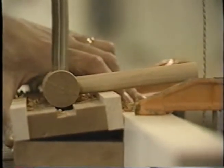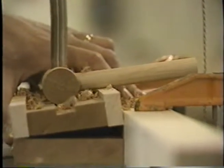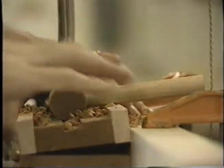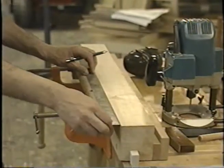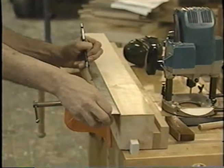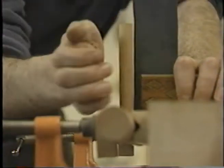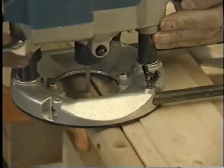All the drilling for the entire chair goes just like this, but with the back legs, I'll have to rotate the peg downhill, adding 7 degrees to get the necessary 97-degree angle. Now it's back to the mortising block, where the job is to route grooves for the chair's back slats. I've set up some grooved and hollowed grip blocks on the jig to hold the legs snugly. Make sure I'm square to the bit and plunge out the slots.